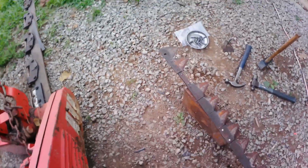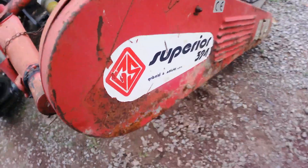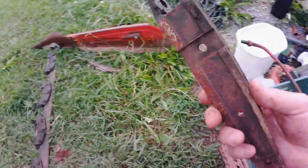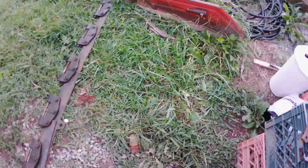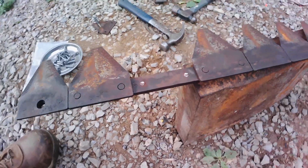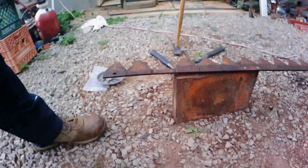We're working on a sickle mower. I've had it about a year now — it's an older model Superior 394 double-action sickle mower. I sheared the foot off of it last year; it moves the sickle bar and I'm just now getting around to fixing it up. It's a good mower. I'm gonna put a tooth on — this sickle section I knocked off is loose. There are two rivets in here and I'm gonna replace it.